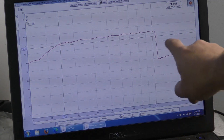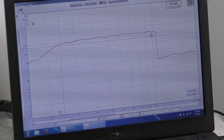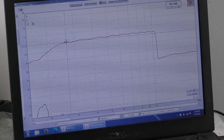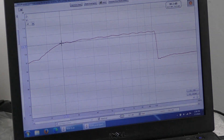You can see here is the line — that's 105, that's the 105 mark. That is 106, so we have 1 dB variance down there. Just below it, it's still 105, 104.7. So 102 is right at 22 hertz — that's going to be our F3. Before it starts to fall off at all, that 105, we're at 25 hertz.